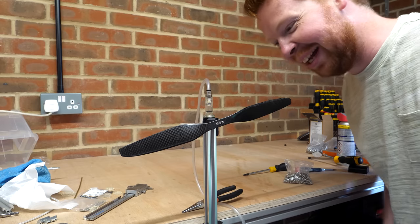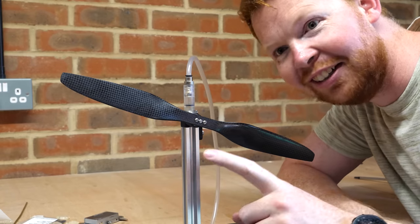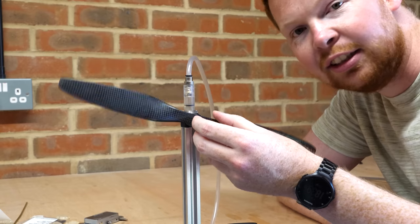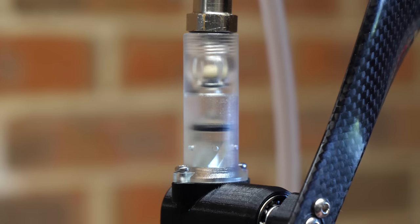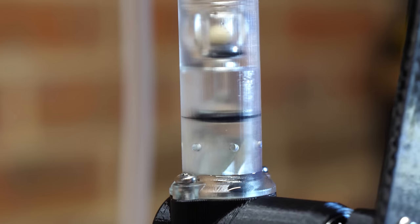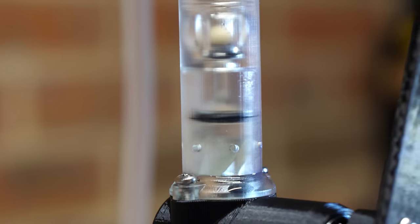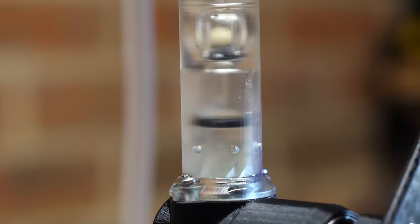I did not expect that to work, first try. I've just noticed something very interesting. The O-ring doesn't seal at all when it was at like 60, 70 PSI, but now this is at 80 PSI. When I push the piston up to the top, it seals, it leaks to start with, and then the pressure causes the O-ring to expand and actually seal against the wall.